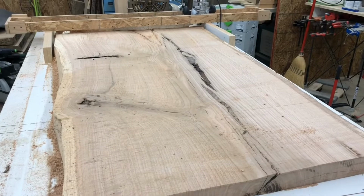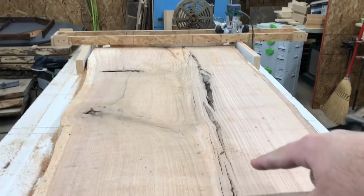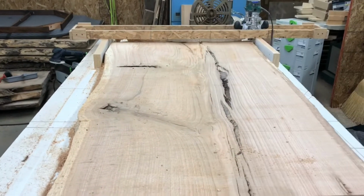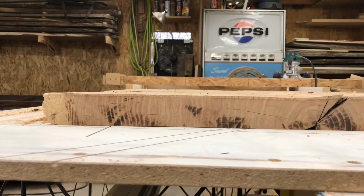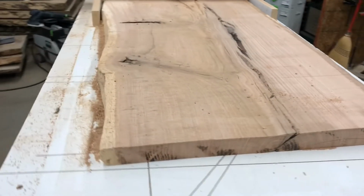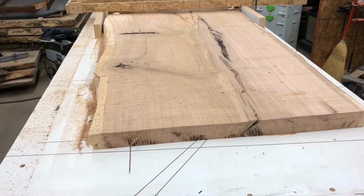All right, I got this flipped over. Started taking off my second level on the B side, getting closer to totally coplanar. You can see in this area, it didn't really touch it, and I took everything off here and up in that corner. It's basically the same as when I started on the A side. You can see it's still just a little low. My final thickness is actually going to work out really well. At this point, I really could stop. I'm going to put some struts across here, some channel to reinforce this, but this is really the process. That's pretty much it. It's pretty straightforward.